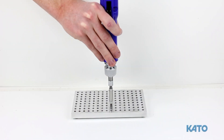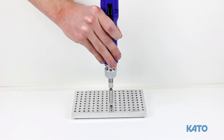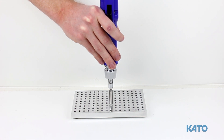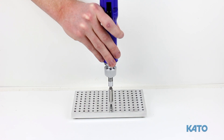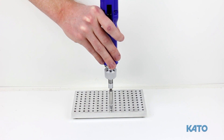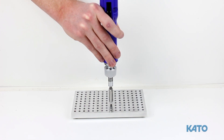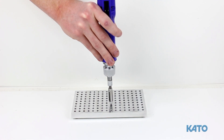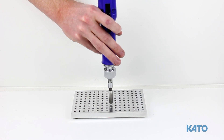It is very important to remember this is an auto-reversing tool. Once you press the trigger, do not release it. After the insert is installed, the mandrel will bottom out and cause the electric driver to reverse. Continue to hold the trigger until the mandrel exits the installed insert completely. Releasing the trigger will reset the tool, and pressing the trigger again will cause the tool to turn clockwise. If you accidentally release the trigger early, simply press it again and the tool will re-enter the installed insert, bottom out, and reverse.